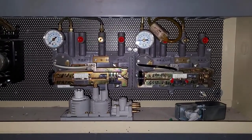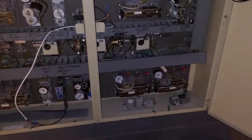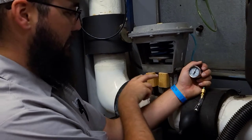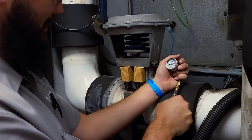I have a feeling there may be something going on with the chillwater actuator itself. Those blocks you saw — we're going to pull those out, see how the actuator responds after that, and troubleshoot from there, getting hooked up in series with the signal. We want to pull the blocks out to do some testing, and this will also be a test to see if the actuator is even functioning.